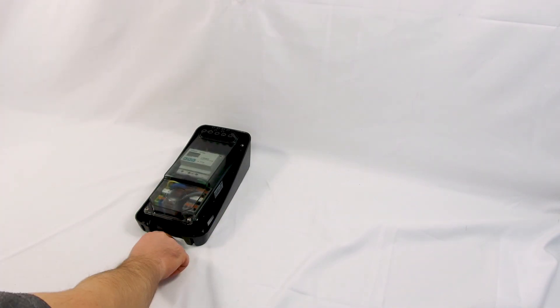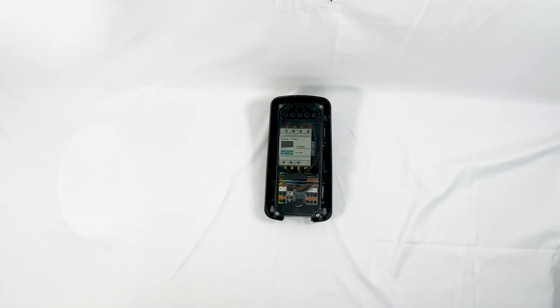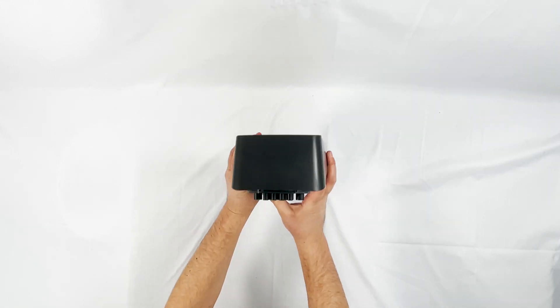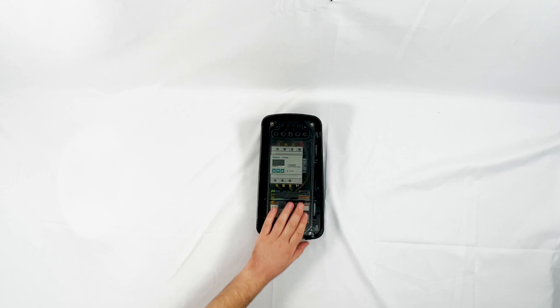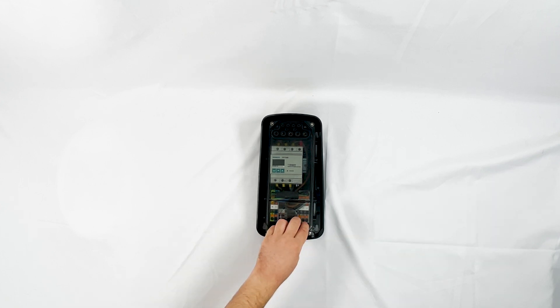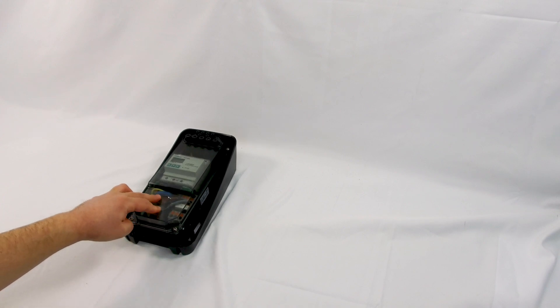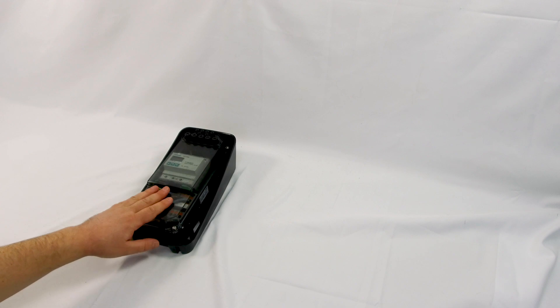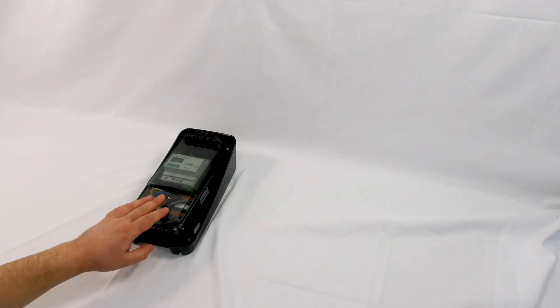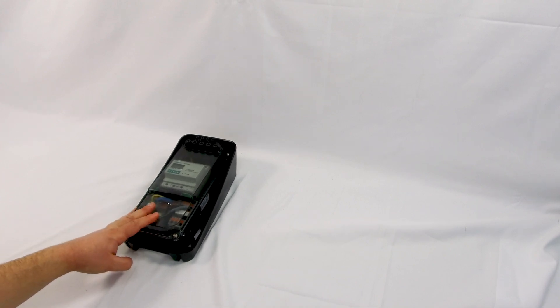What I like about the back plate system is that installers can fit it quite easily. You use the cardboard cutout from the sleeve to drill your holes, then mount the back plate to the wall. Inside you'll find WAGO terminals for electrical connections — you ferrule the cable ends and insert them. Unlike normal screw terminals which require ongoing maintenance and can be over- or under-tightened, these are maintenance-free and more reliable long term.